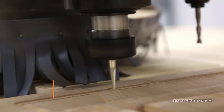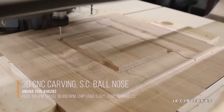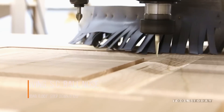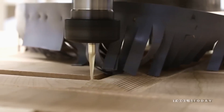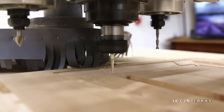With the planing and roughing done, it's time to do some finishing. This is the Amana Tools number 46282 — a 5.4-degree tapered ball nose with a quarter-inch shank, ZRN coated. I just can't say enough about the finish that this leaves.